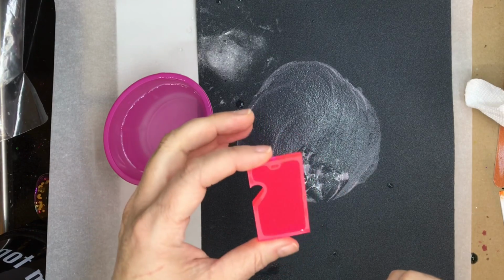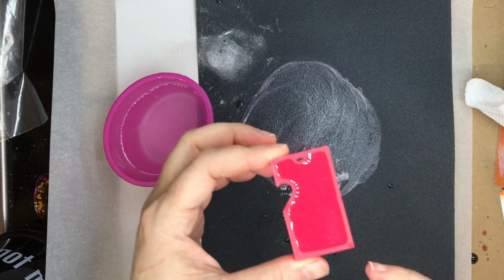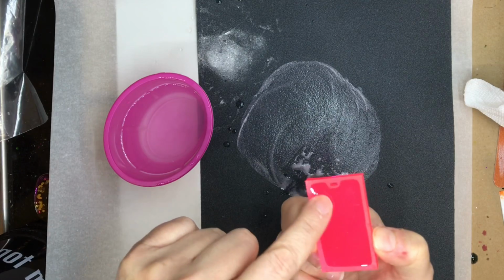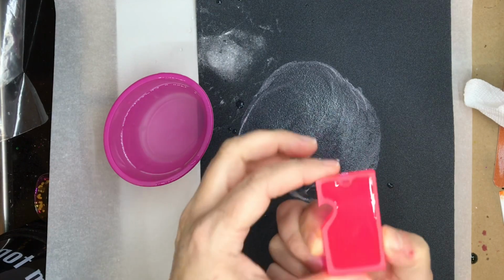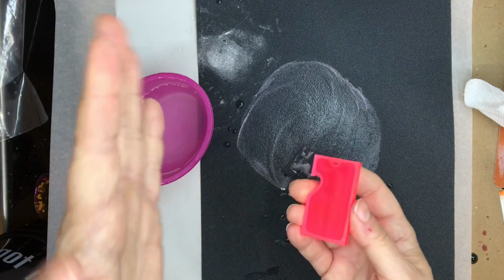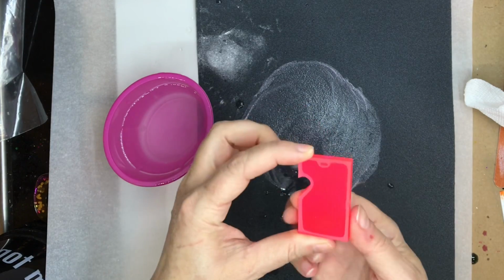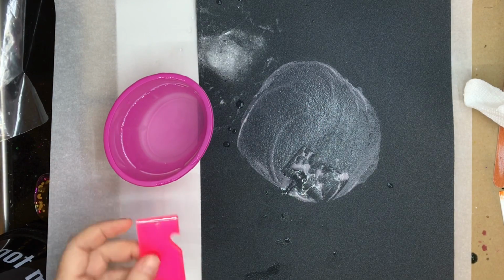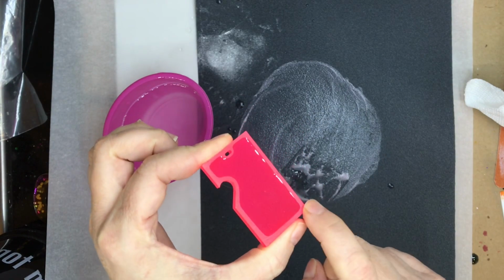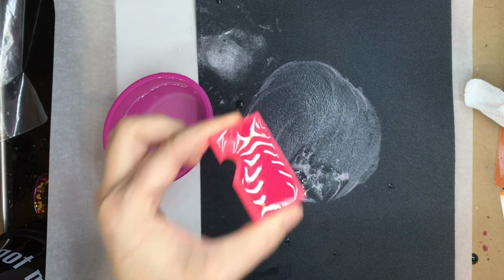So you might be asking, well, let's just speed this up and go directly to like 1,000 or a 2,000. You know, I wish it worked that way. I know that would be a lot quicker because nobody likes sanding, but you're not going to get out all this coarseness. It'll make it a little better, but it's not going to make it perfect. And so you really need to go down gradually with your grits of sandpaper to get it looking really nice and really smooth. Okay. All right. My little pro tip here is, if you're going to recoat this with another layer of resin, end with 1,000 grit or higher sandpaper. Otherwise, you're going to see the scratches underneath your new layer of resin.